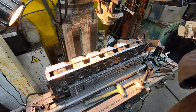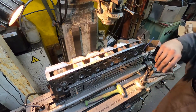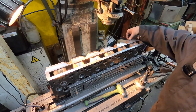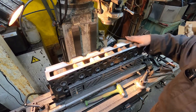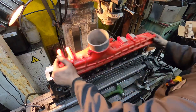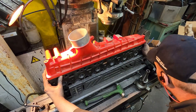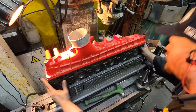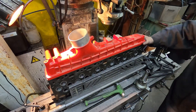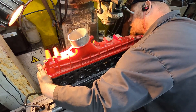I took about a five thou cut off the top of this when I had it perfectly flat — that was earlier. I didn't film that part. When I was rough cutting it off I took about a five thou cut off there, and I'm wishing I didn't now, but it's almost the same angle. The intake is going to work no problem on this, so I can inset it up there quite a ways like I want to — it'll be good.